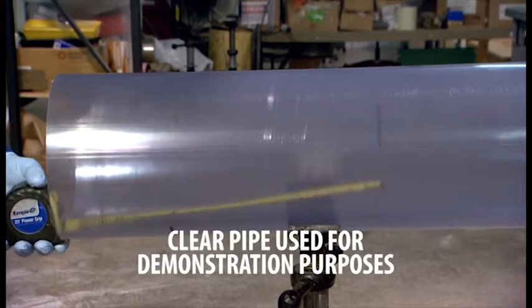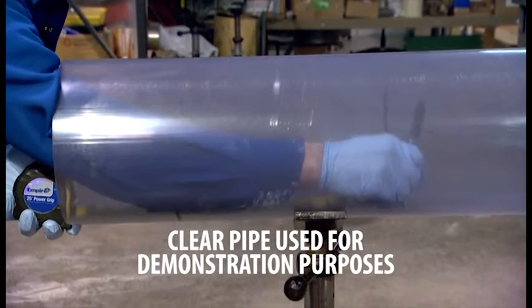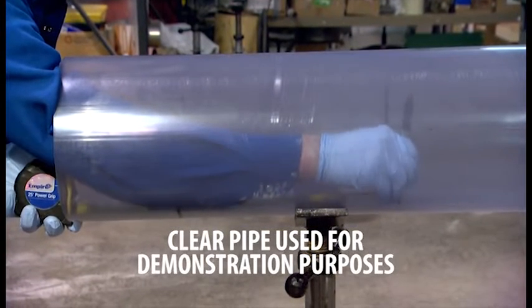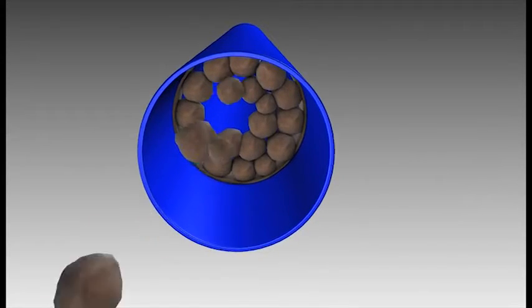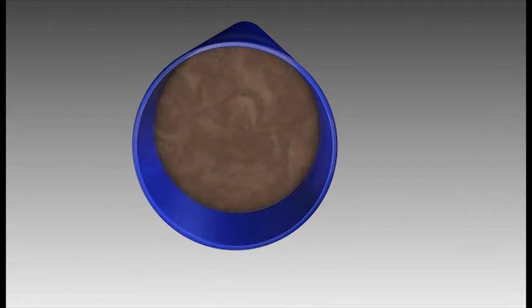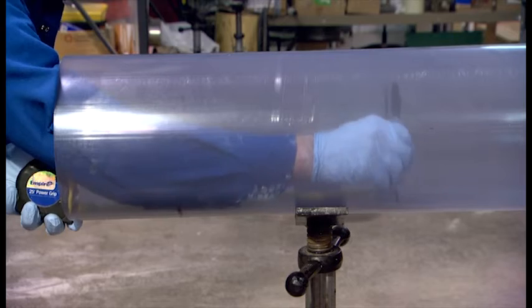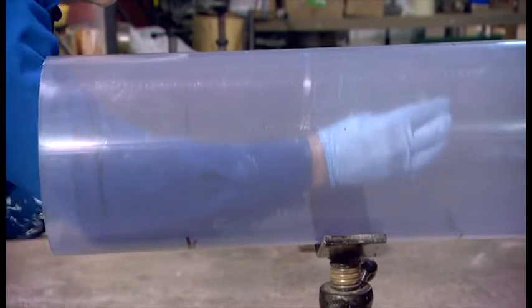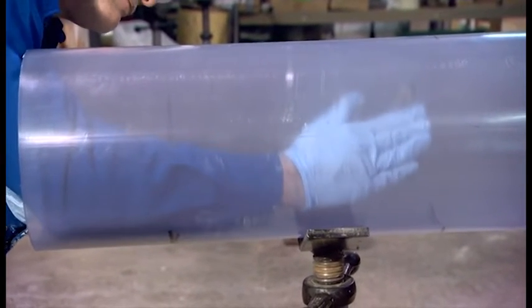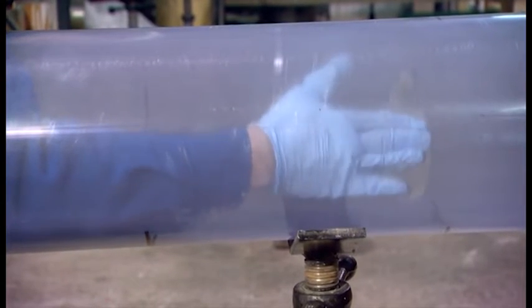Measure and mark the beginning and end point of the mud plug. The length of the plug should be one and a half times the width of the pipe diameter. This measurement should take into consideration how far the end point of the mud plug should be relative to the opening of the pipe where activities such as torch cutting and welding will take place. A small mud ball can be used as a marker at both locations. To begin, create a thin layer of mud on the inner surface of the pipe by rubbing a mud ball over it. This will ensure better adhesion of the mud ball to the inner surface of the pipe.